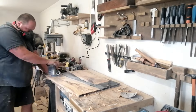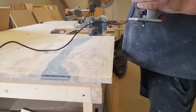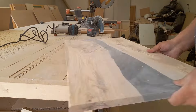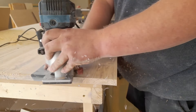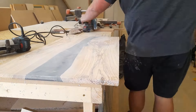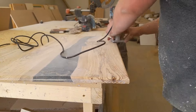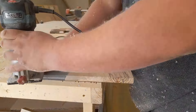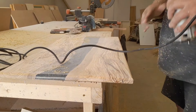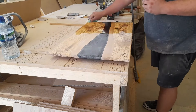I was planing, surfacing, and sanding in between while checking with a level — a long and tedious process. Once the sanding was pretty much done, I'd sanded it down to 240 grit. Then it was just a case of finishing the edges. I thought about putting a fancy detail or chamfer, but I ended up doing a simple round over, which I think looks nice and smart without being overpowering.